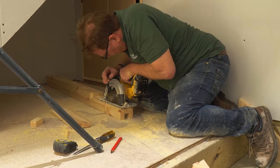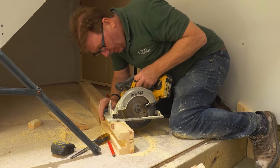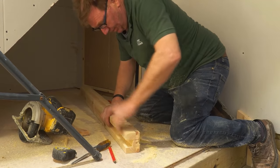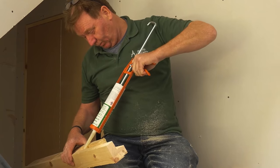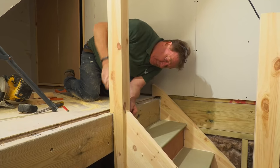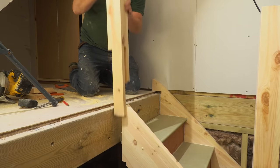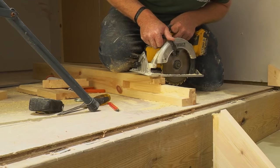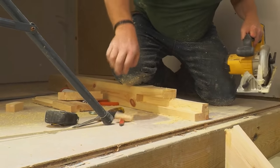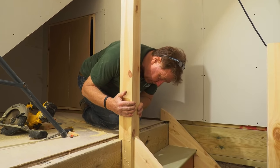What we would have maybe done with clamps some years ago, in a joinery shop, you might have got a couple of sash clamps out, and in fact you'd need more than two because it would spread in the middle. Exactly. The polyurethane glue can push the strings apart slightly. So you stick a screw in there to hold it in position while the polyurethane glue goes off, which is 5 minutes. After that, you could take those screws out, but why bother? There's no point. Just leave them in there, unless you've got a market for secondhand screws.